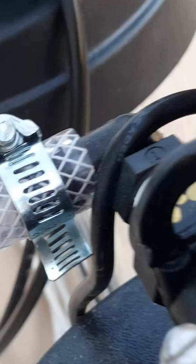On the drain line, what we did here is we teed the drains together. We came out of the filter, looped over, and put a T in here. We ran a line from the water softener with hose clamps — you want hose clamps on both of those, this one over there too. We ran it along the line and into our sewer line.